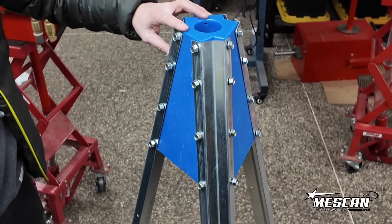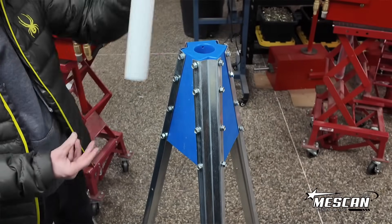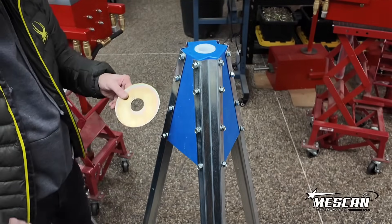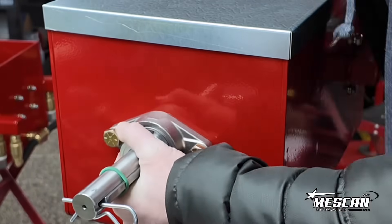Although the color of the plastic tower top may vary among brands, most diaphragm windmill tower tops will generally resemble this design. To install your new Joe Mescan windmill bellow compressor, simply insert our custom-made tower top adapter sleeve into the center hole of the tower, add the included pivot washer, and insert your new bellow compressor onto the tower.